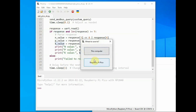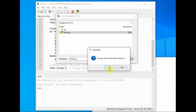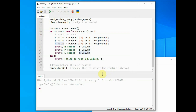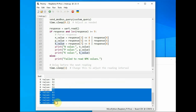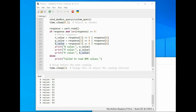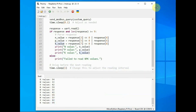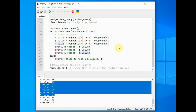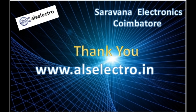Store the file on your computer as a .py backup, and also save it inside the Pico as main.py — that naming is required so it runs automatically. Click the green Run button and you will see the N, P, and K values displayed in the bottom shell, the same values as seen earlier in the RS-485 Sensor Configuration Tool. Thank you for watching.